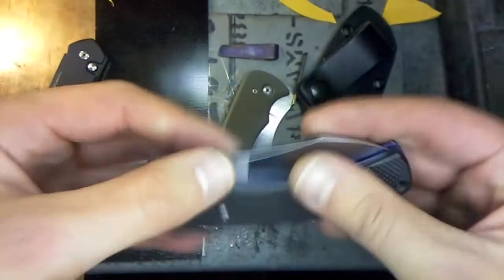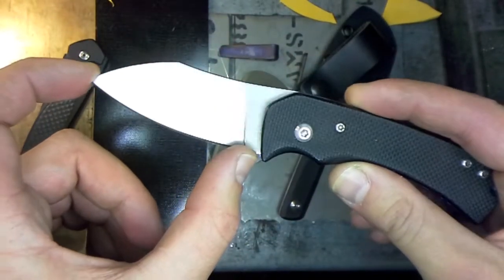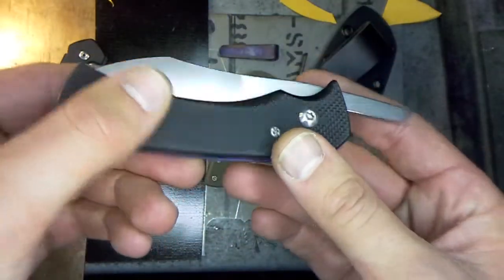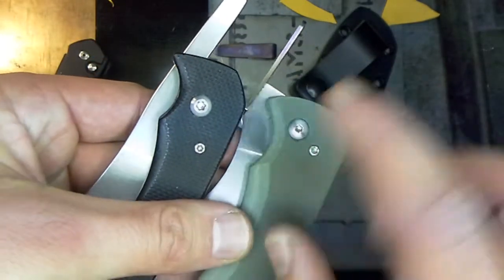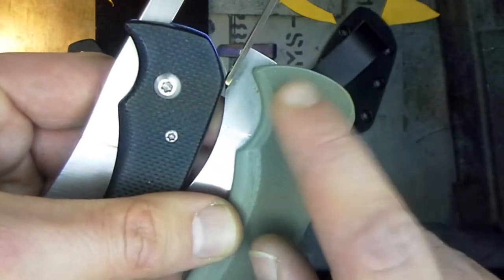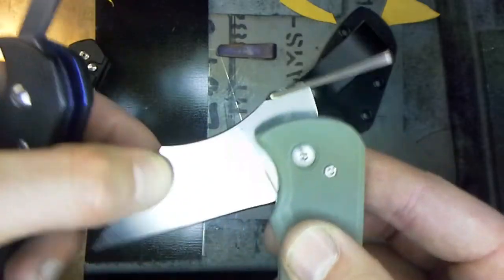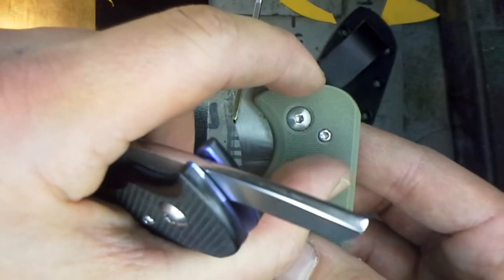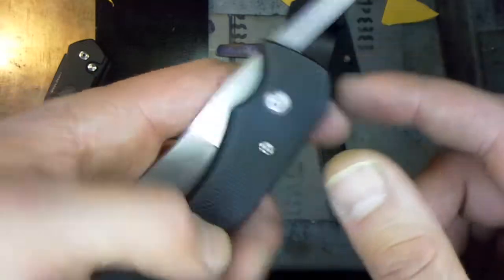About a three-inch blade with the cutting edge a little under three inches, and a four-inch handle — not the best handle-to-blade ratio. This was one of my first steel friction folders, so the pivot design is a little off. On a slightly newer one I've got the design pretty well optimized to keep as much blade length as possible — the edge starts about an inch from the pivot versus an inch and a half of wasted blade space on this one.